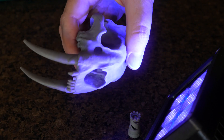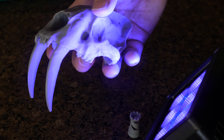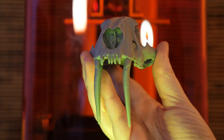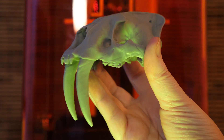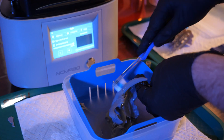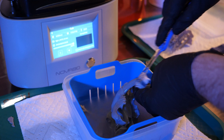The last tip is to be patient. You don't have to rush into post-curing — you can do that tomorrow or next week. Until you post-cure, there's still time to clean the part better and remove any leftover resin or scaly stuff. But after you post-cure, you can't. So clean it, dip it, rinse it with fresh alcohol, and inspect it really well before exposing to any UV light. If it doesn't look clean before post-curing, it won't look clean after.